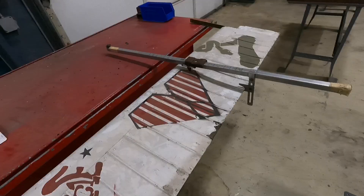It's more of a check to see that they're falling within range. This is not an approval video and not meant to be a step-by-step. We use Cessna flight controls here at the school, but your DME might have a Piper or a Beechcraft, so make sure you're referring to those manuals. Typically, flight control balancing is under the structural repair section of the manual and not under the flight control sections — which is a little weird, but that's where it ends up in a lot of older manuals pre-ATA chapters. After ATA chapters were introduced, they're actually typically in the flight control chapters. For Piper, sometimes it's in a service bulletin or service letter. Make sure if you're at a DME, you're asking for the procedure.